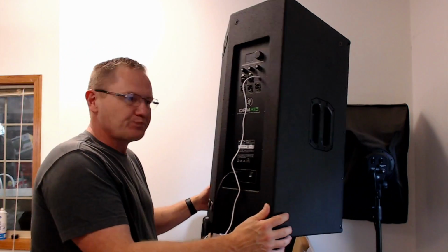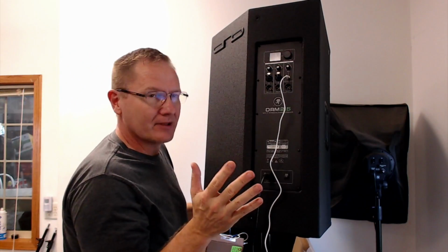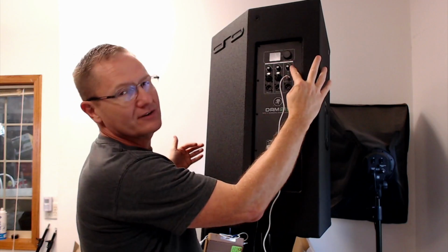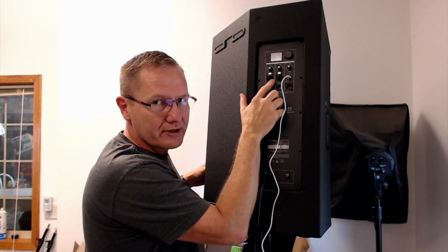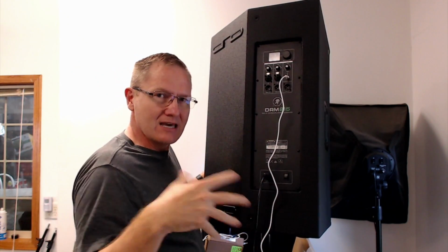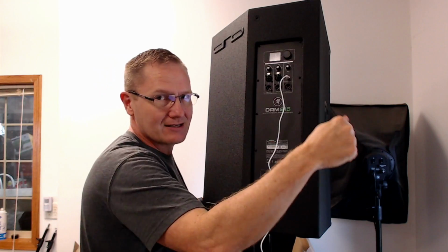Moving to the back, we have a 3-input capability device here. We have our channel 1, 2, 3, and 4. Your 3 and 4 is basically where we're running in with a source with a 1/8-inch jack. I've got a combo jack where it could be 1/4 inch or XLR, and then we have our through capabilities. So I can go into the sub, into the top, into the top, into the sub, whatever direction I want to go, or into the top and piggyback to the next one.